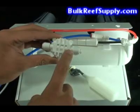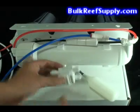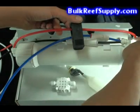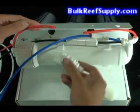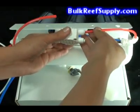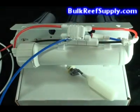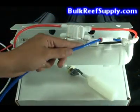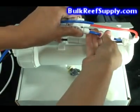Next we'll install the auto shutoff valve. Make note of the in and the out, as well as the side with the screws and without. Make sure the screws are facing you when you install the auto shutoff valve. You're going to snip the red line that goes from the last carbon block directly into the RO membrane — just cut it in half. The water leaves the carbon block, goes into the auto shutoff unit, and then out of the shutoff unit into the RO membrane. Next, snip the purified water line that comes out of the RO system, making sure to do it after the check valve you installed. Again it goes into the in, and the other tube goes into the out.